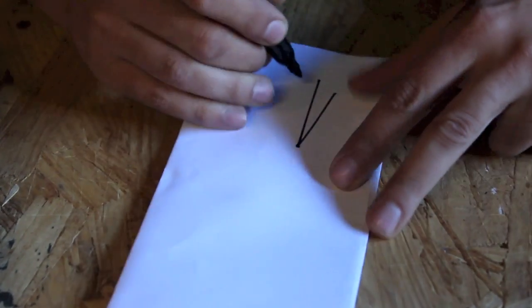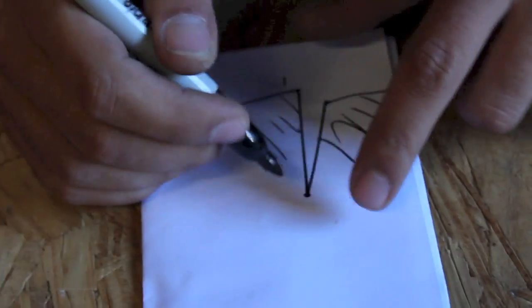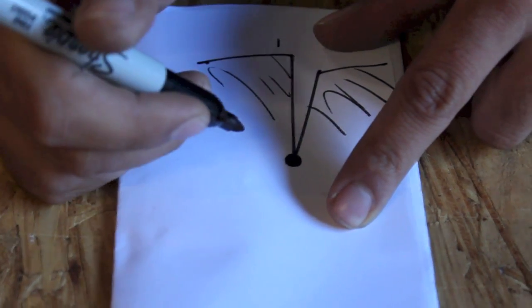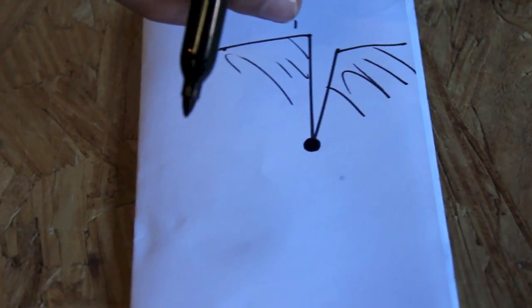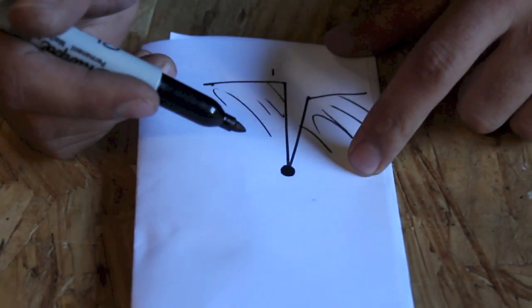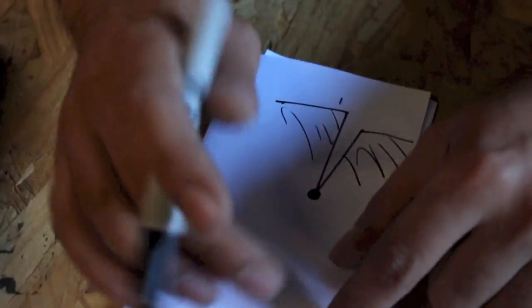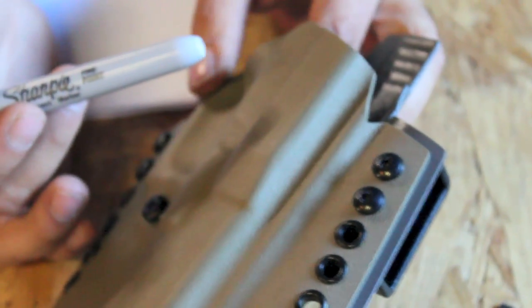Do something small that will help transmit that stress a little bit better. So if I have a very narrow cut — say this is a cut in my holster and this is Kydex here — as this moves, this becomes the point of flex. What you can possibly do is take a very small drill bit and drill a stress relief hole there, such that as it flexes you're not creating a crack — it sort of goes around the hole. That is one option for alleviating that stress. If you do it small enough and precisely enough, you can maintain that aesthetic and not create a situation where a precise cut turns into a crack over a long period of time.